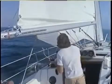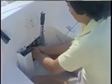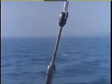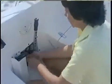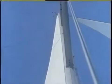As the wind comes further aft and the boom moves well off the center line, the main can really be bagged out. The outhaul is eased substantially, allowing the foot shelf to open up. The baby stay is released, so the mast can straighten up and the permanent backstay is eased along with it. The Cunningham should be cast off as well, and the runner can be used to hold the spar absolutely straight